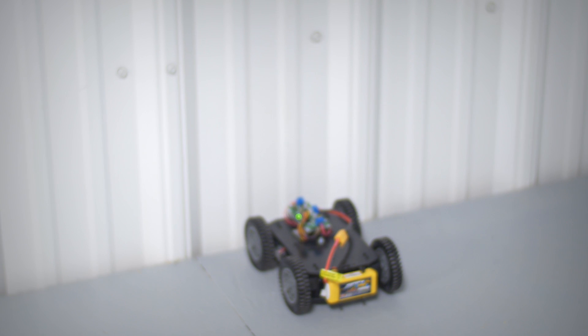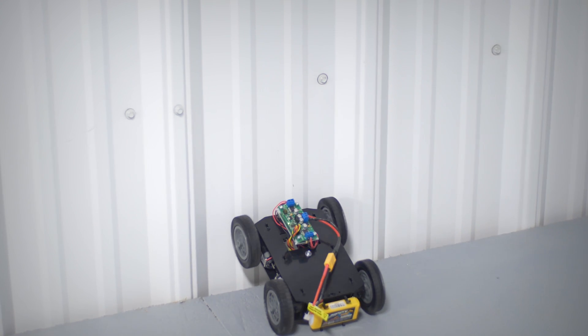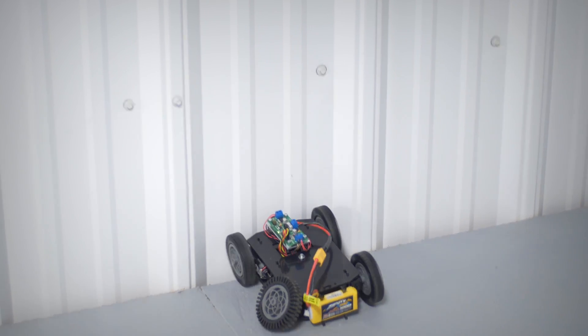I think now it's time to hook up the electronics. Now that I have the electronics in place, I'm going to do a quick test to see if I can drive from the floor to the wall. The wheels have been popping off while testing on the girders, so they're more free to pop off now — they've come a little loose. The other problem is the breadboard clamp I'm using to hold the battery is hanging too low and back, hitting the floor and preventing the transition all the way up the side. So I'll have to rethink where I place the battery.